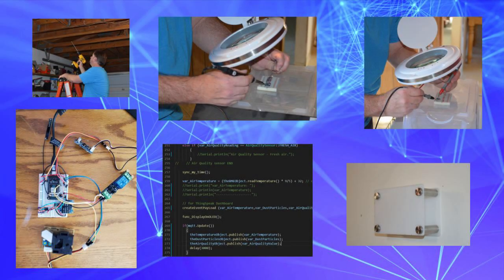And now the work begins. Wires need to be run from the power source to the area the unit will be placed. This means drilling a hole in the roof to access the power wires between the solar panels and the fan that they drive, soldering a few of the components needed, verifying with a continuity tester that the solder connections were good, pre-wiring all the components together, then writing the actual program in C++ using Visual Studio Code IDE, and finding a suitable location on one of the garage walls.